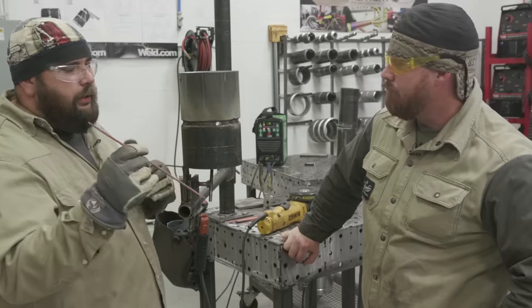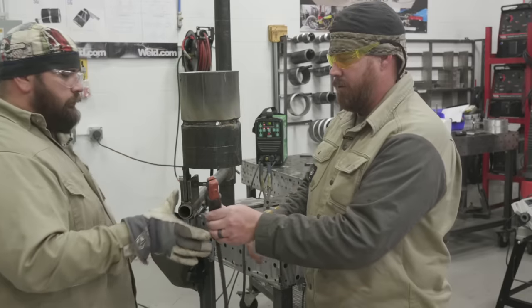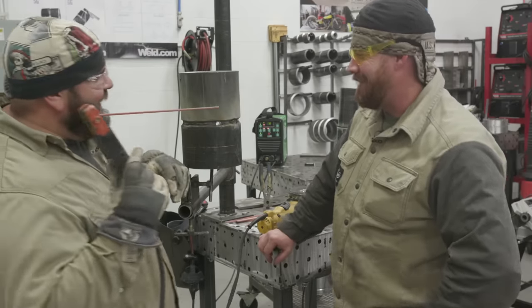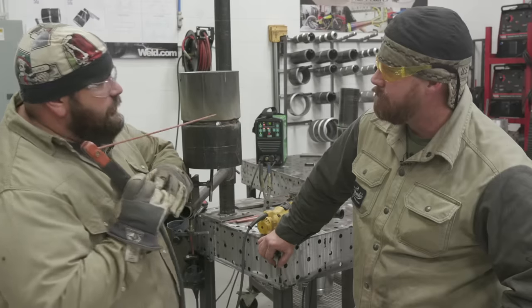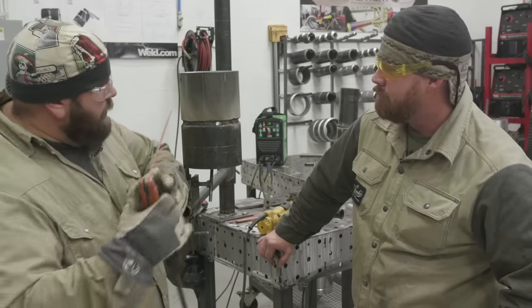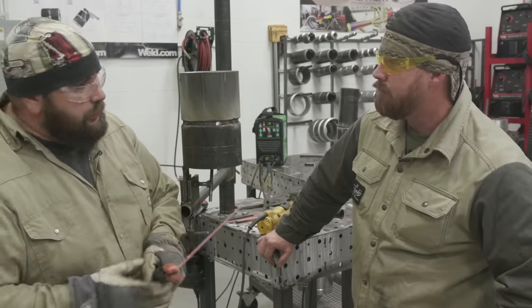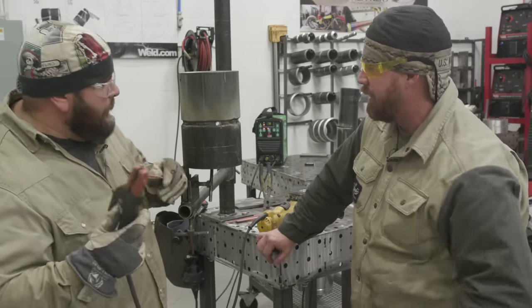I like to hold my electrode on a 45-degree angle down in the stinger. Show me that real quick, just for the folks at home. So like this, and right there I can get a lot of motion just right here. If I was at a 45-degree angle up or even straight in, there's a lot more movement. So this tightens up the radius that I'm actually moving. So now you're spinning from your wrist as opposed to your elbow, shoulder, full body.